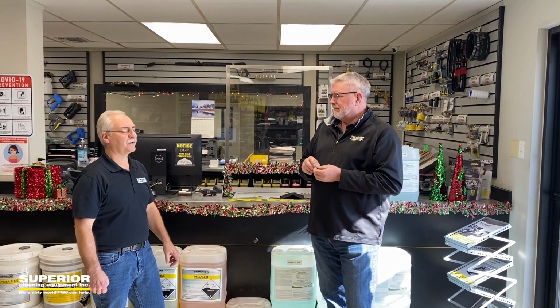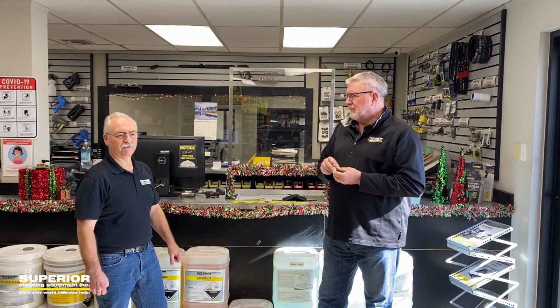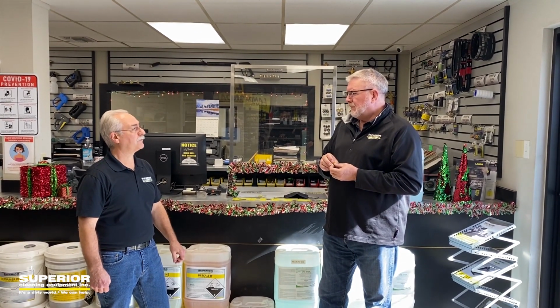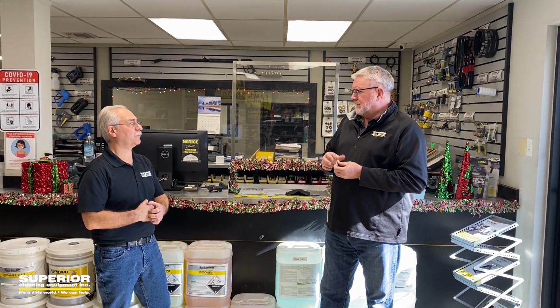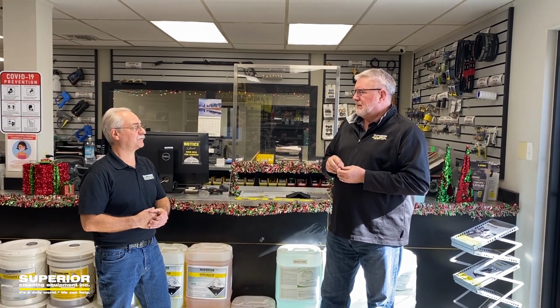Yeah, and especially with electric motors, if you use too small of an orifice or nozzle, you overload your motor. You're going to kick out. You're going to trip the breaker. Okay. So that's really crucial there.